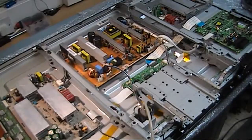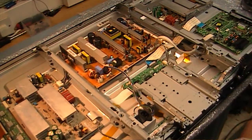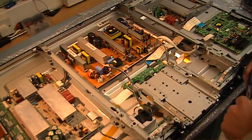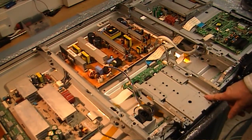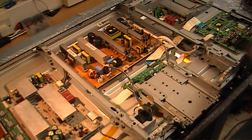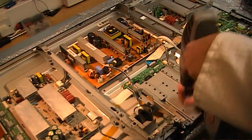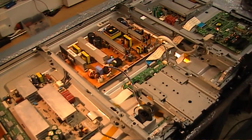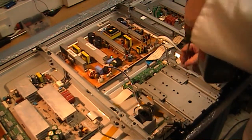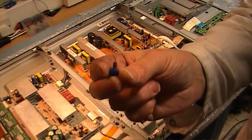I will just reposition this now and unplug the unit. I will leave my short in to chassis for the power supply. What I want to do now is take off this cover — there are 4 screws holding it. The bottom ones are normal self-tappers, and the top ones have a little blue plastic on them and are not self-tappers.